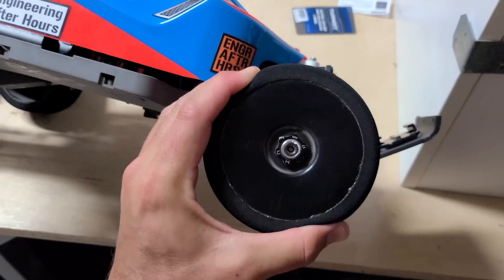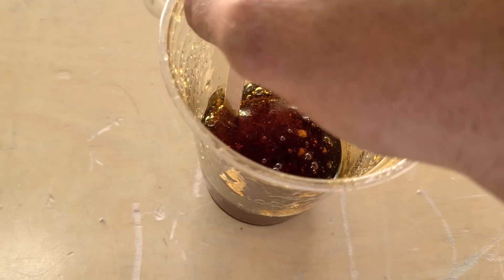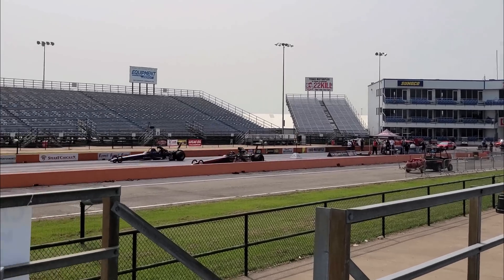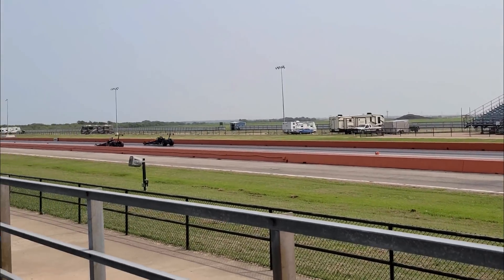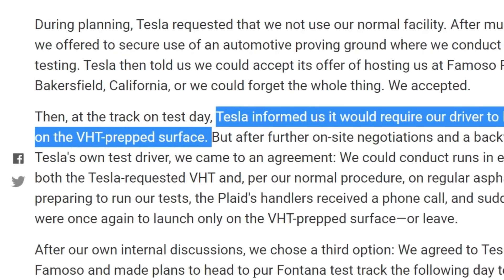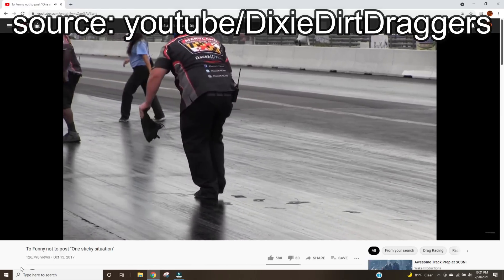To increase the coefficient of friction, I'll be running really soft foam tires and prepping them with a non-toxic adhesive to get maximum grip. Dragsters run on a specially prepared surface that's pretty much a glue trap, and Tesla has indicated that to get their more impressive 0-60 times, they run on a similarly prepped track. I'm just trying to remain consistent with what advantage the Tesla would have.